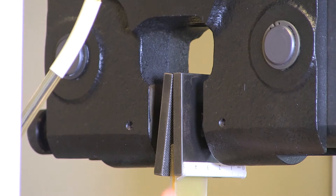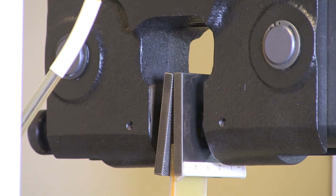Here you can see that the flat surfaces are not parallel anymore, and this is bad because it has a risk that your specimen can slide when it is loaded under tension. Also, it can be under compression before any test starts, and this compression can lead to early damage.